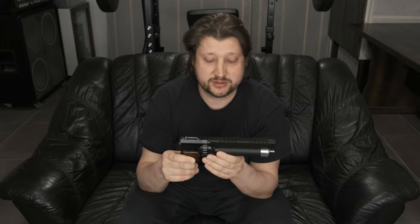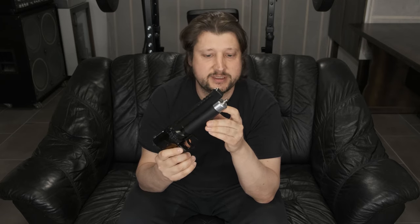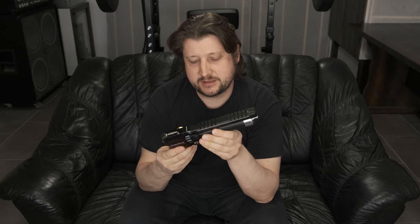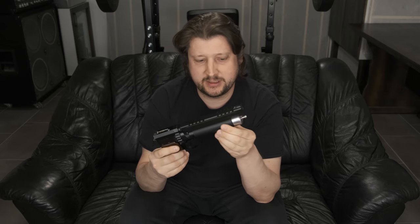But first I want to discuss the added features that I was able to make in the time between the release of the first video and this one. So the thing that you can see immediately is the end cap of the cylinder is now different. That's because I made this one myself. I explained the reason why I wanted to do this. It's mainly because the original takes up a lot of available air volume in the cylinder. So this is one of the reasons. I will discuss this more in a little bit.